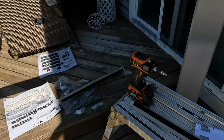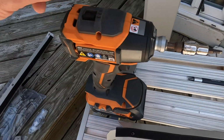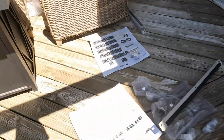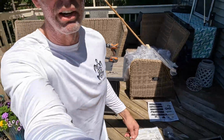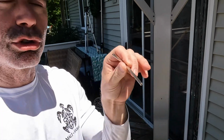That's the biggest tip. Get yourself one of these guys, some kind of power tool thing. That's a 4mm. I've got another one here. I think it's a 5/64, no, 5/32. That works about the same. Get something. Oh, you know what you could do? If you don't want to buy those bits, you could chop this off and just put it into a normal drill chuck and use that. But either way, I wouldn't be putting all the screws in by hand.